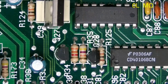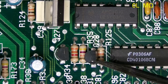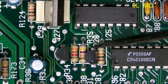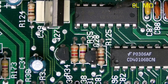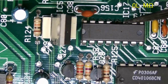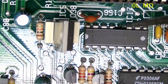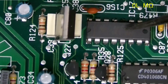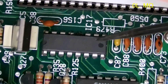Oh no, people, it keeps getting worse. I saw this transistor right here that looks like the side of it blew chunks out. Then I noticed there's a trace going from that pin snaking around underneath this IC, and then I saw that right there: this chip also burnt up. You can see there might be a tiny little hole right there, unless it just spattered. So this chip here fried as well, and the number on that says APC 2010.